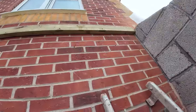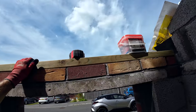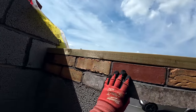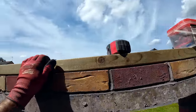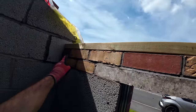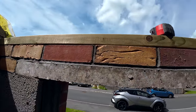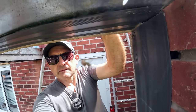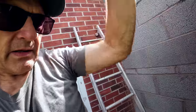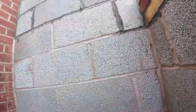I've got our wall plate on - got seven grabbers in, it's that solid. We've just gone to put the wall plate on here, which we should have done earlier but never got around to. We should have bedded it. The reason we're definitely going to bed it now is because it's got a dip in the brickwork - so rather than trying to pack it up and mess about, we're just going to put a thin bed under it, get it in the right place, and then fix it down. It's a bit quiet for work next week so we've got Monday's work and we're just going to do Tuesday on this - get a full day, early start, make sure we've got all the gear we need.